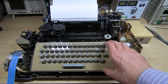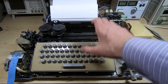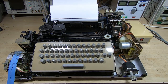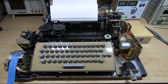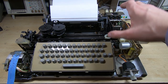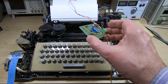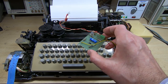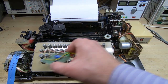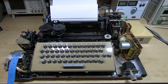The way I've decided to configure this is in full duplex with no local echo. If I want local echo I can have the remote machine echo any characters that I send to it, and then anything I type here will appear on the receiver after being repeated by the remote machine. To make this work, I've turned the printer back to how it would have come out of the factory. It had been modified — I've shown this board previously — but I decided I didn't really want it as it was going to complicate the operation. It just enables you to trigger the reader from a remote machine, which I didn't want, so I've removed that and returned the wiring to a more standard form.